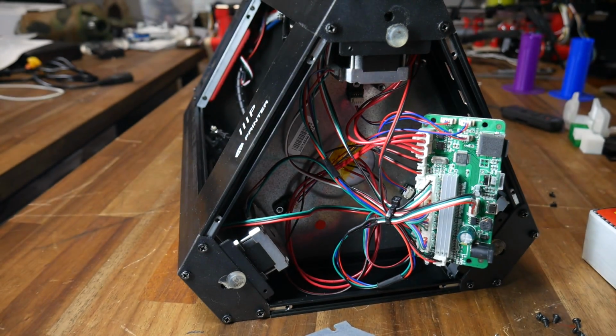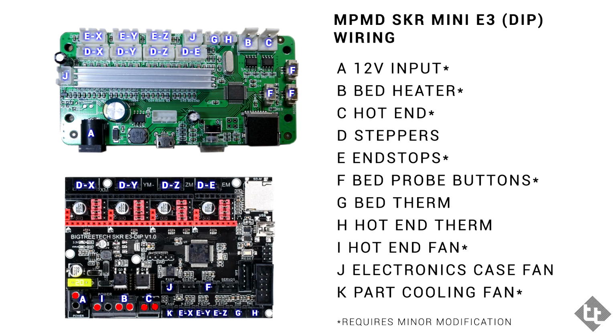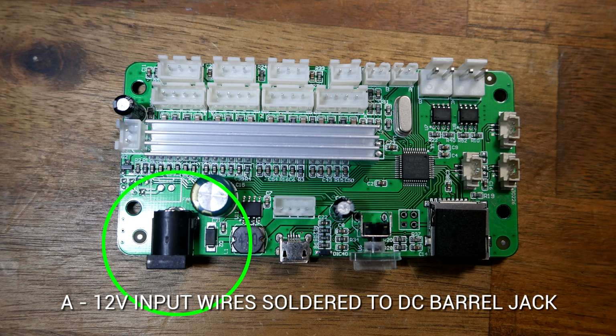Here is the wiring diagram for the conversion. It's linked in the description so you can print it out if you like. About half is plug and play and the other half requires minor modifications. We'll work our way through the list. The new mainboard uses screw terminals, but the original one has a power jack mounted on board.